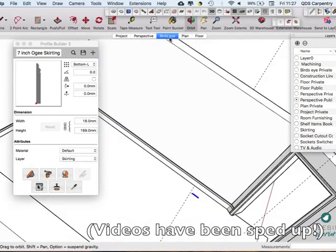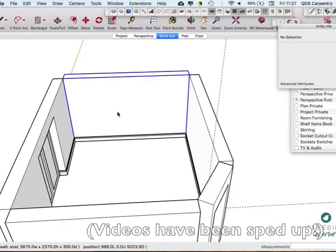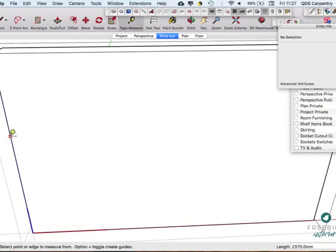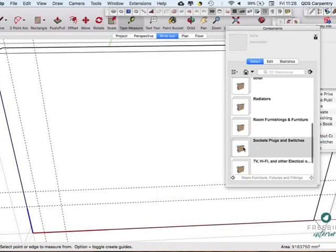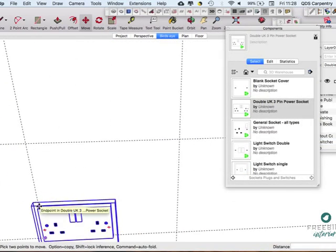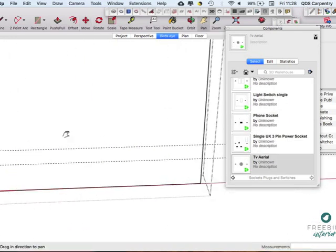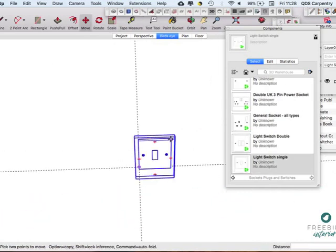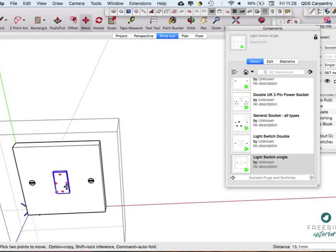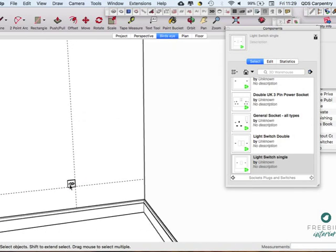And while the customer's looking at that and filling that out, I do a hand drawing of the space. I use something called a pyramid liner. I recommend looking that up if you're in this line of work. It's a backer sheet with fine grooves in it, which when you put a thin sheet of paper on the front, you can draw at right angles. So I can draw a fairly accurate measured survey by hand, put all my dimensions on using the tape measure. I used to use the laser measure, but I've lost it. So that's that.